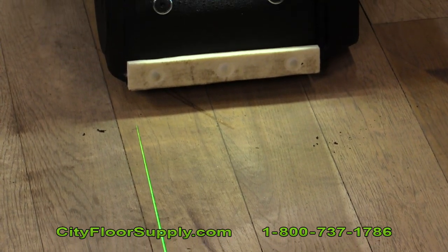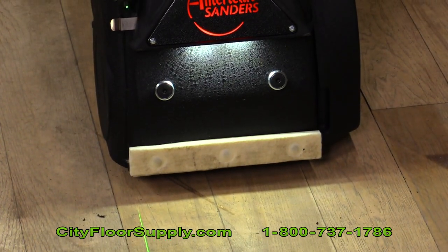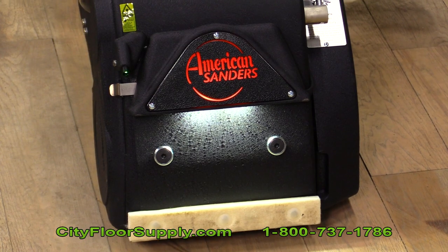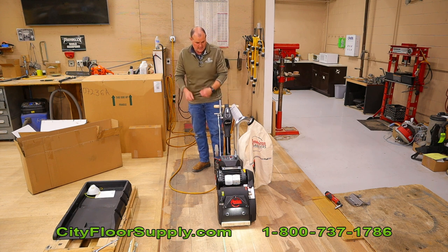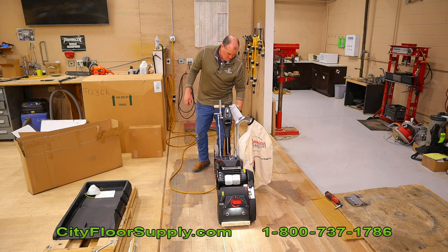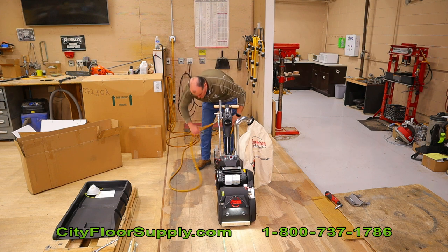If you lose power to this machine, you're gonna have to go back to the machine to turn it on. So if you go hit the breaker, it's still plugged in. The LED lights, all the voltage lights, the hour meters, everything will light up, but the machine won't start until you reset that breaker. So that's just a safety feature. We've all seen edgers take off when somebody kicks a breaker and goes and turns it on and it's laying down. Well, maybe not all of us, just some of us.